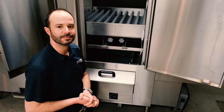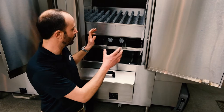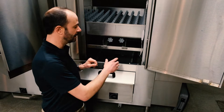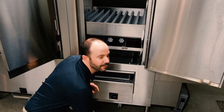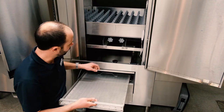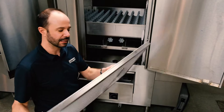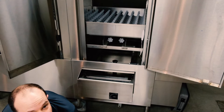Here in front of the pre-wash section, where you load plates and dishes, this is the first section we address. For the in-between meal period cleaning, we want to make sure this pre-wash basket is cleaned out properly. Start by taking the cover off — you can hang it right on the machine — then reach inside and pull out the scrap screen. Take it over to the trash can, knock out any larger items, then take it to the three-compartment sink and wash it out if anything's stuck. Set it on your cart.